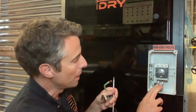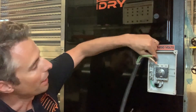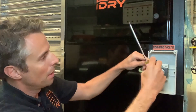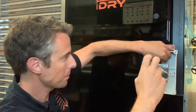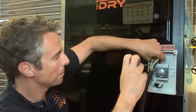There are your L1 and L2 power wires. These are the main wires that power up the control panel that's just above me. And then, of course, a ground. So we're going to take our black wire and put that to L1 and get our connection nice and tight. And our white wire here to L2. And then finally, our ground. This is a simple thing, but should be done by your local licensed electrician. Thanks.